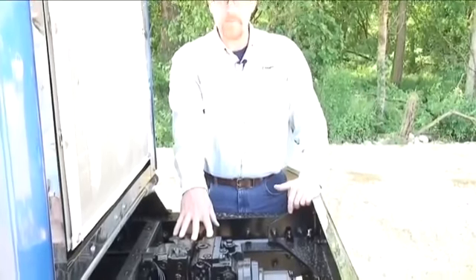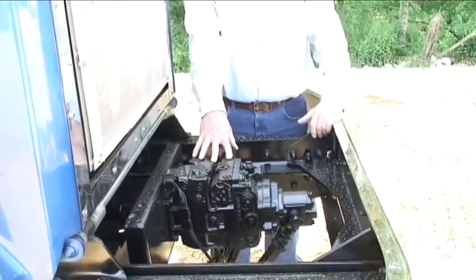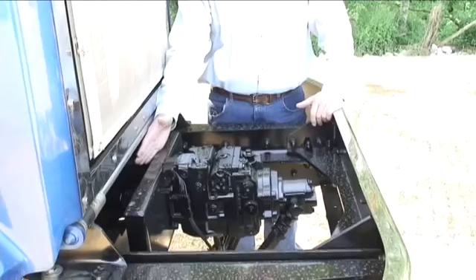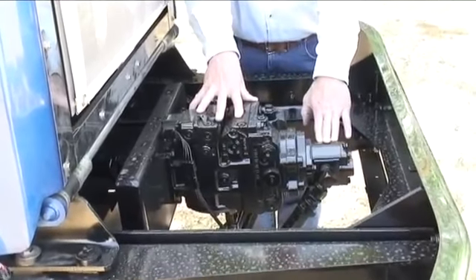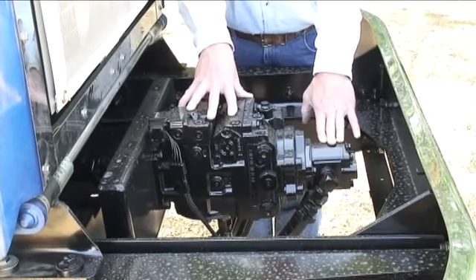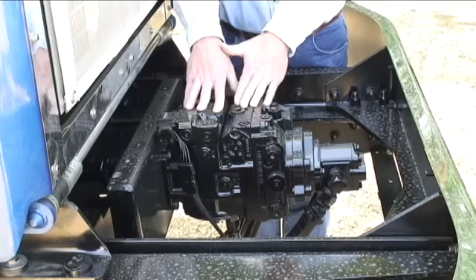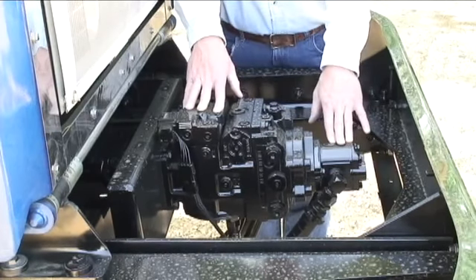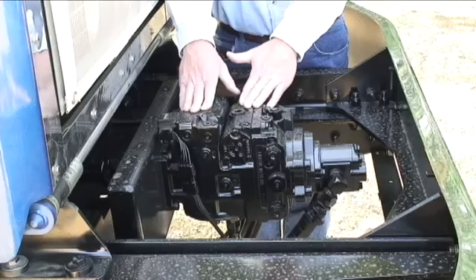On the front of the truck, we drive our system by crank drive or live power. By using live power rather than PTO drive, it allows our system to continue running all the time whether the clutch is pushed in or out, so when we take off we have instant starts without the delay of a PTO engaging. On crank drive, we're running directly off the engine with a 90 series hydraulic pump along with a smaller gear pump. The gear pump controls the lift, shift, and fold of our spray bar, separate from the main hydraulic pump which controls the asphalt pump. This allows us to shift the bar, raise the wings, and fold the bar even while spraying, without taking any hydraulic oil away from the actual application rate of the distributor.